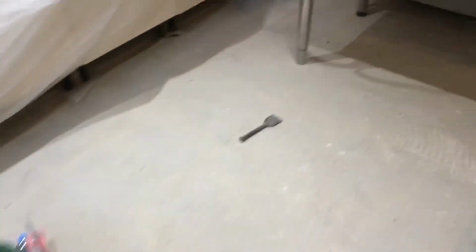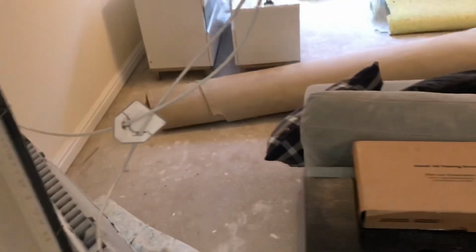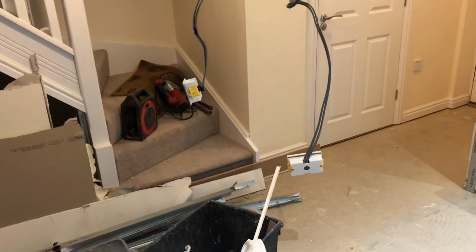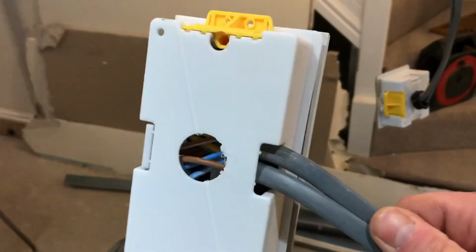Okay, so that is looking a little bit better. All I used there was a nice pair of gloves and my metal cutters. The metal's all gone now. Doesn't look so bad now, but what I'm going to do, when I get rid of these sockets, is put these in a jointless maintenance-free box, and use some Wagos on them, and they're just going to go above the ceiling.